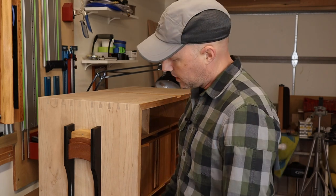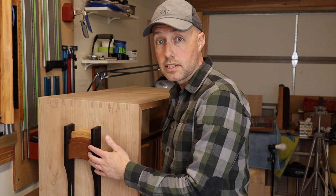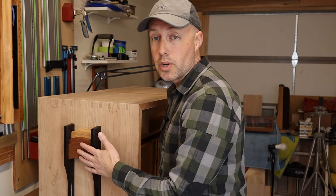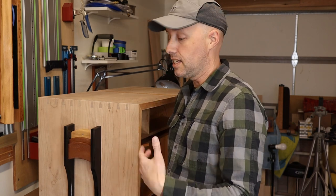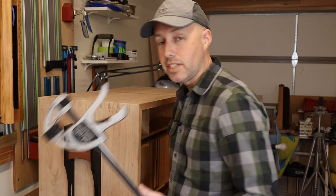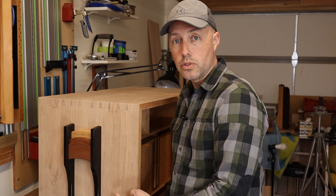RC from the Montauk Joyner Shop here. I just finished installing these shop-made chest lifts on the side of my Bargueno desk, and in the interest of making these as strong as possible I ended up gluing them directly to the case sides. I needed a way to clamp that glue line so that it set up nice and strong, and since I don't have clamps that could reach the middle of this, I ended up using screws.